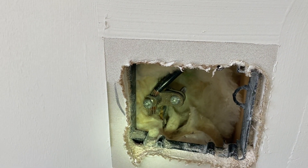That's not going to make a good connection. Being that this is a new construction property, it shouldn't be a big deal to have the builder come down here and tighten this up so that the grounding electrode is making a proper connection with that piece of rebar, and the home is properly safe and properly grounded.